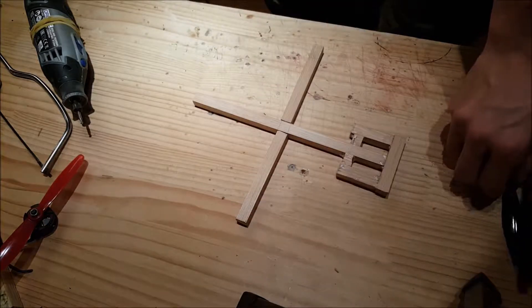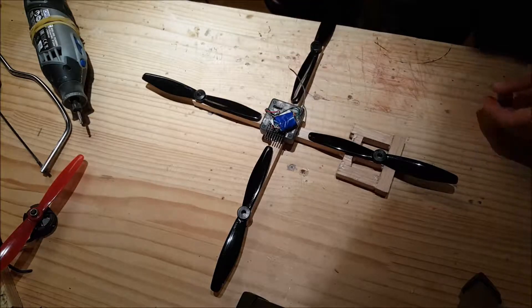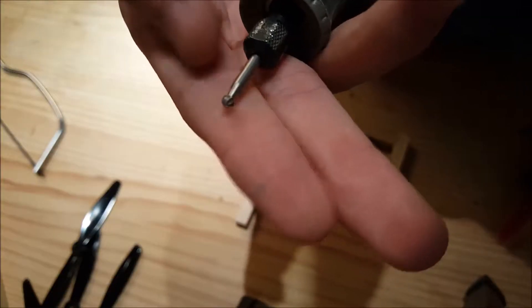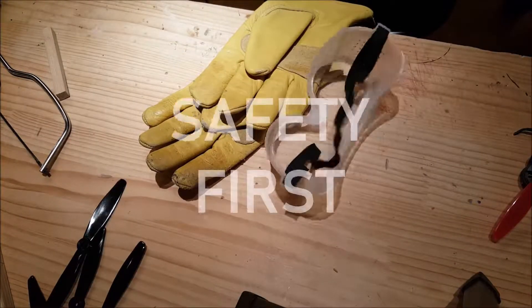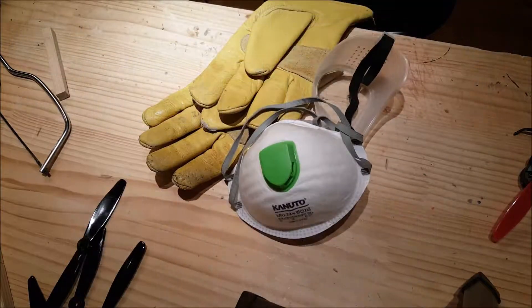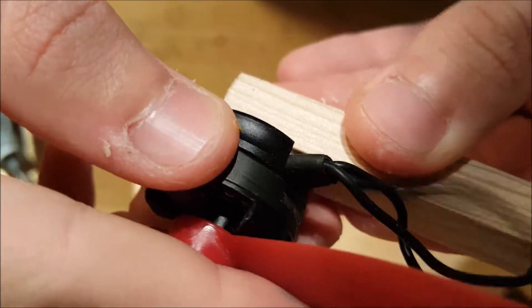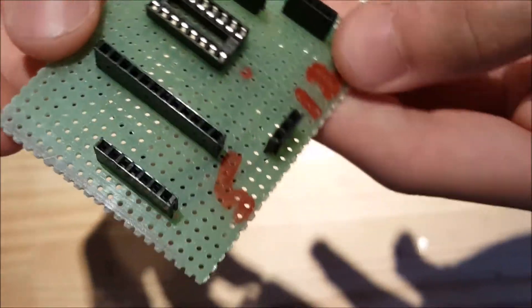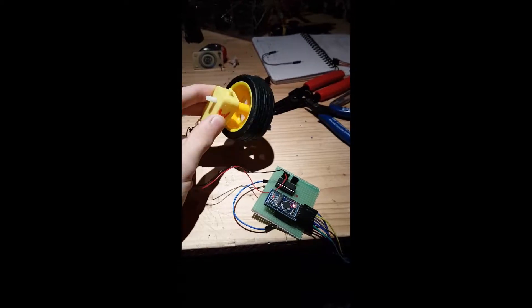I made a test fit with the props to see if I had enough space for the flight controller in the middle — it seemed fine. The brushless motor shafts protrude underneath, so to mount them I had to carve out an indentation in the end of the arms with my Dremel, but remember to put safety on even for a Dremel. The indentation worked perfectly and the motor sat flush. I then made the motor wheel controller using an Arduino, L293D, and a perf board — I made a separate video on this controller, the link is in the description below.